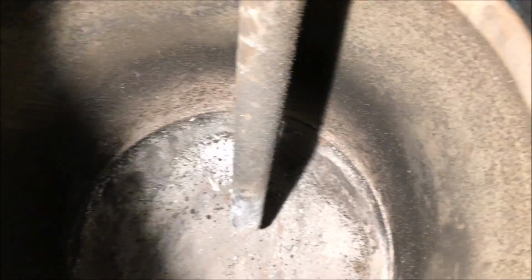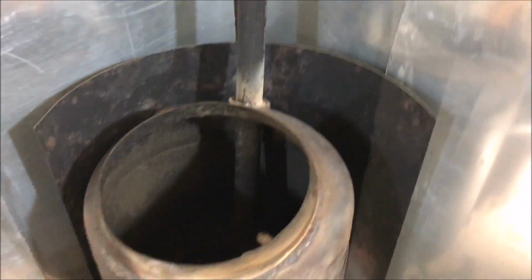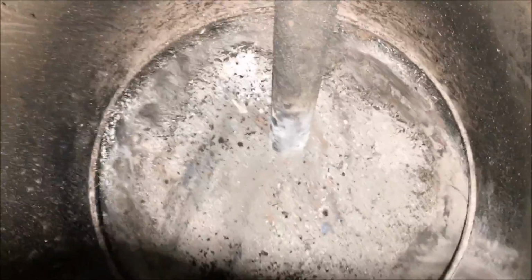In the past, I've always run Cyclone combustors, which have been the best, because what happens in a Cyclone is this here. The air swirls in and it spirals, so the ash is flung to the outer side, and not as much of it travels out the exhaust discharge as would had you configured it otherwise, like I did in this case, which I thought would be conducive to a very hot fire, and in fact it is.